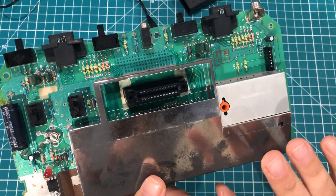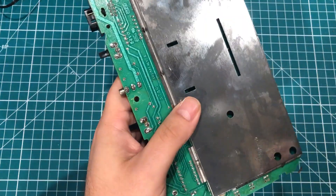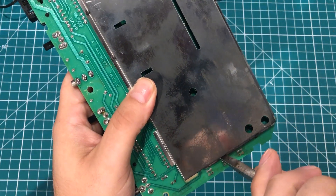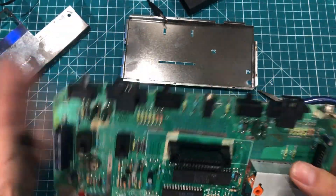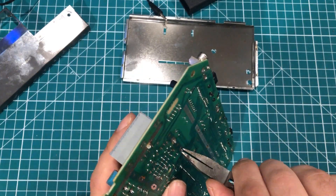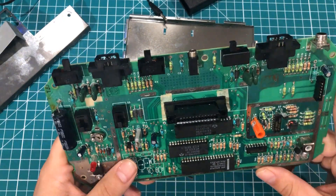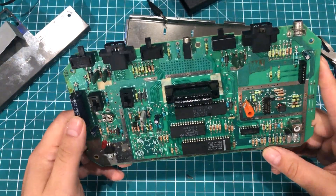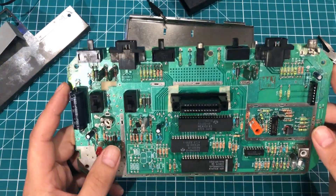While I'm waiting for those PCBs to come in, I'm going to take off this RF shield and see if I can find any surprises. It looks like it's held on by twisted metal, so I'll come around with some pliers and straighten that out. There's one more clip over here I didn't see - this one's a little twisted. There is the naked Atari. I took my time getting that off - no sense damaging the board. The good news is I don't see anything exploded. This capacitor could be bad; there are only a couple of electrolytics on the whole thing.